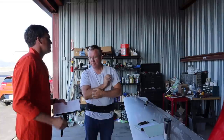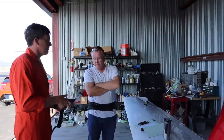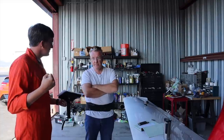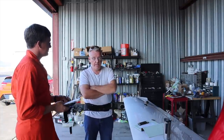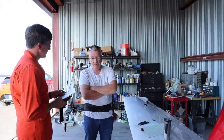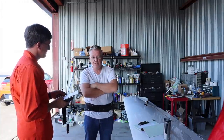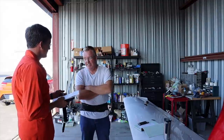Yep. Once we're in the cruise configuration, though, do you want to do a rich of peak, lean of peak thing? Do you want to go find a peak and then try to get on the rich side of the lean side of it? Do you want to just set it to, say, 1300, call it good for today? 1300 is good. I don't think we should go lean of peak because it's a carburetor. One is going to be lean, one's going to be rich, it's just going to work. Okay. Yeah. So just set it to 1300 for the cruise portion.